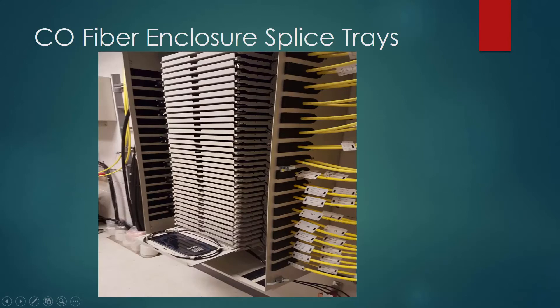Here's a close-up of the cable tray splices — how they're tagged. And once again, here's the conduit coming in from outside, and then they're brought up and the actual polyethylene jacket is stripped back, gets down to the buffer tubes, and then they are spliced together.